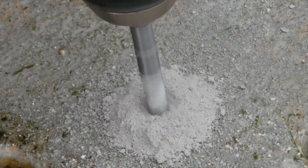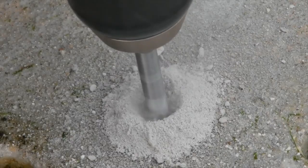At $20 for a five-piece kit, you can get these at Home Depot. It's not a cheap set — you can obviously buy a basic bit pretty cheap — but I think you're going to get a lot longer life out of these with the tungsten carbide tips, and you'll have the ability to drill through steel even when working in concrete and you don't know what's behind it. So $20 for a five-piece kit of a much better bit than your standard bits — I think it's not a bad deal at all. It's the Bosch MP500T.